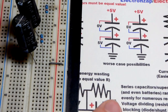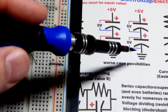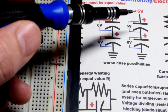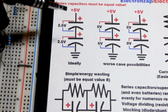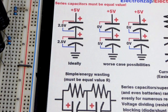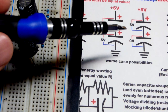So you can see five volts on one, zero volts on the other. The reason why you usually use capacitors in series — in this case like supercapacitors — is that you can't charge them up to five volts. Most of them have a 2.7 volt limit. So you put at least two of them in series, and then it splits up the voltage so you're within a safe limit. That is one of the main reasons. Also, you notice these capacitors are polarized. Usually you put them in series when the voltage you want to store is more than what the capacitor can handle.